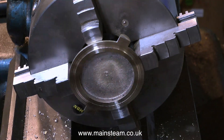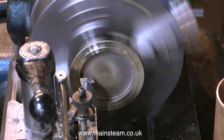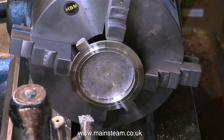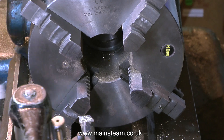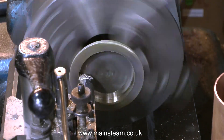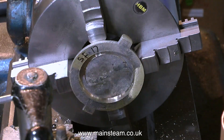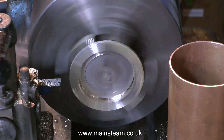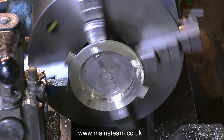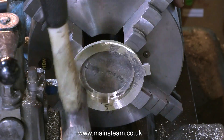For the next part of the operation I'll be moving over to my small Boxford lathe, but before I do that I'm using a boring tool to clean up the inside edge of the casting. This will make it so that the three-jaw chuck in the Boxford will firmly grip the part when I turn it round to machine the outer edge. After finishing the first casting, with the boring tool still in the tool post, I machined the inside edge first.